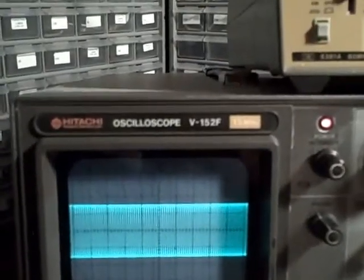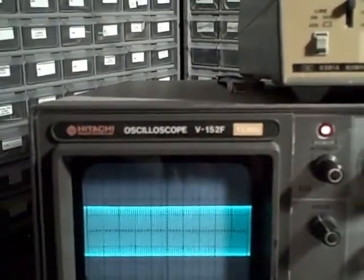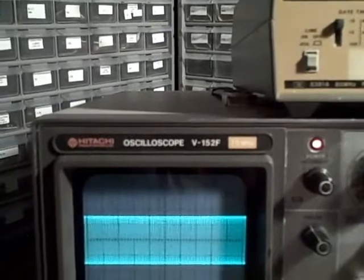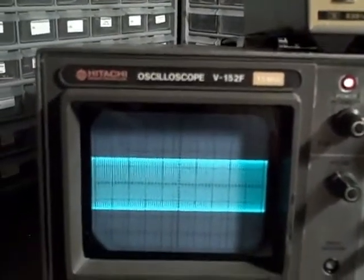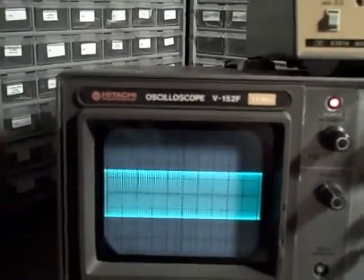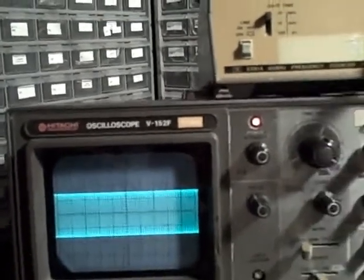You've always got to allow a very small margin of error for my ability to discern the difference between 2.8 and 2.82 or something like that. But it's 16 megahertz. So once again, we've proven that both channels have exceeded their 15 megahertz rating, which is good. The scope is good.